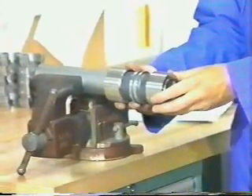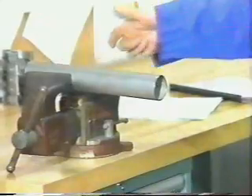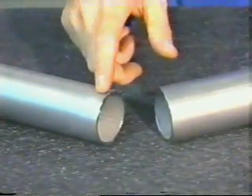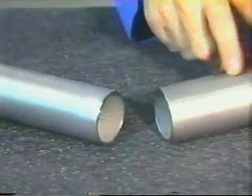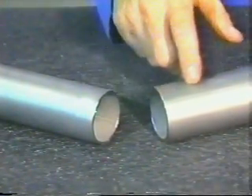When cutting and deburring pipe ends, care must be taken to protect the pipe ends from pipe wrench or vice jaw marks. Pipe ends should be free of longitudinal scratches, pits, flat spots, corrosion, paint, or other debris for a minimum of one and a half pipe diameters from each pipe end.